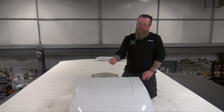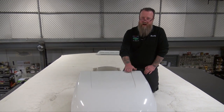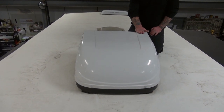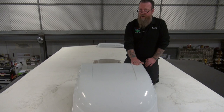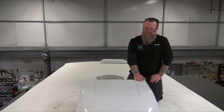Remember the other video — the more airflow the better on that air conditioner, so we just want to make sure those coils are clean. If you're not covering your camper for the winter months, you may want to invest in a cover for the air conditioner to keep it out of the elements and keep those pesky critters out from building nests inside the air conditioner, so it's working when you need it when it gets hot out in the summer.